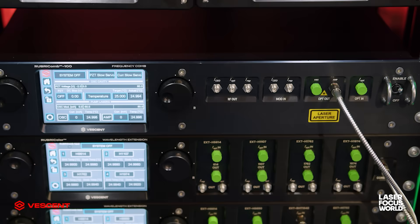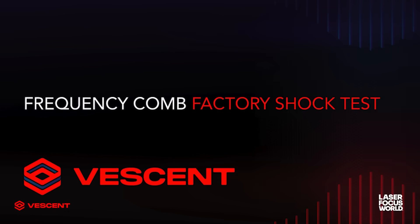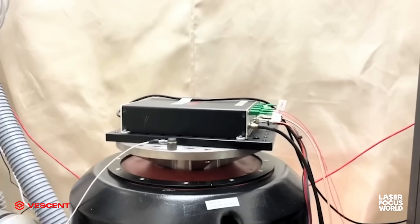You no longer need a cavity to get ultra-cold strontium atoms. It's at a reasonable cost — the frequency comb and a GPS transceiver are COTS components and they can ship in short times. It's also scalable; you can keep adding laser channels as needed. It's also robust — we test every frequency comb we make on a shock and vibe table, and I know it can stay phase locked through 20 G's of shock.